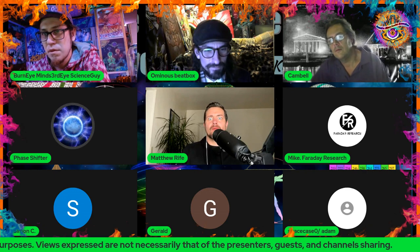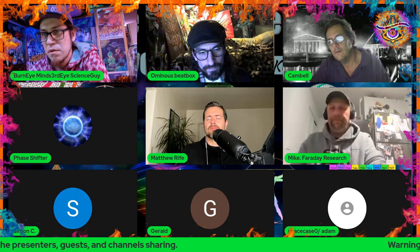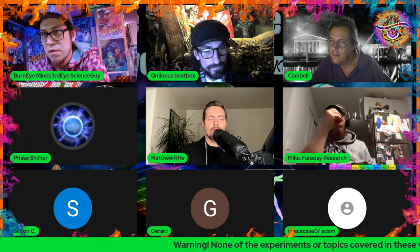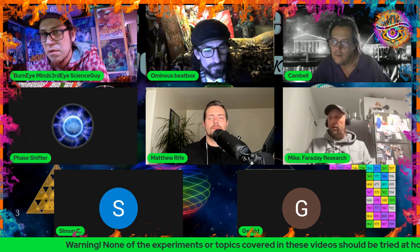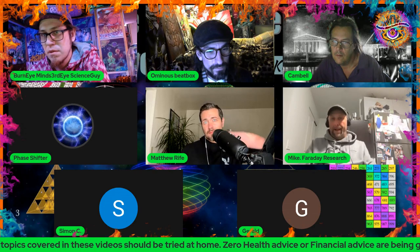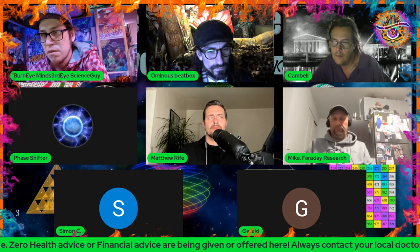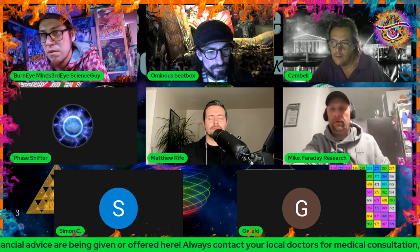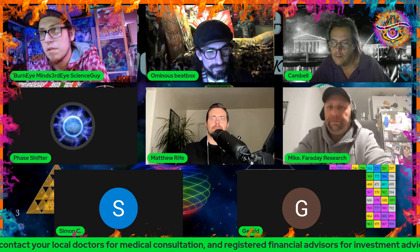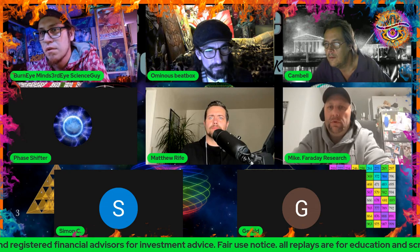What people don't understand about bifilar coils, I think the commonly overlooked aspect compared to a monofilar pancake coil, is that you end up with intercapacitance between the windings. Normally this would be a parasitic thing that we don't want, because it slows down the signal. But in this case, the bifilar effectively integrates its capacitance, the C part of its LC circuit, into the space between the windings, which means an individual coil now has a given LC frequency that can efficiently recycle between the capacitance and the inductance of the circuit. Especially if you're going high frequency, because then the skin effect itself adds to that.